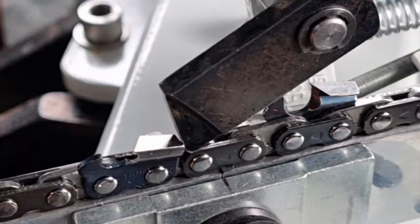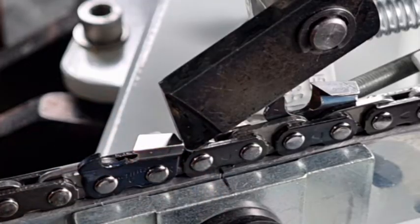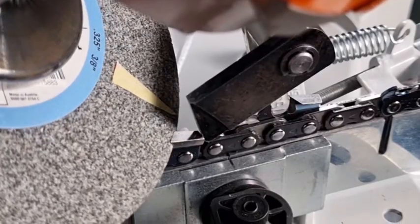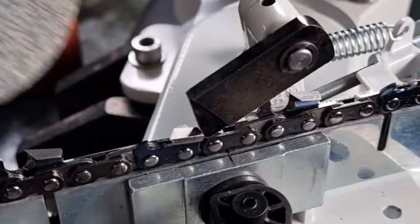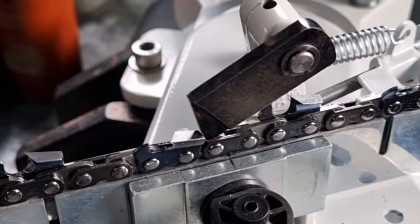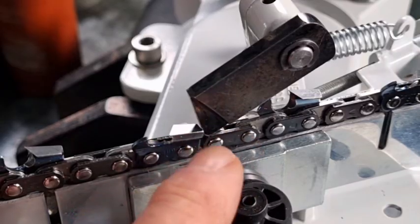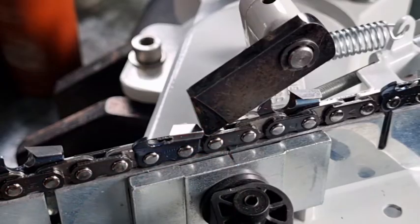When you set it up with the backstop, make sure that when you adjust the knob you bring it up to the face of the grinding wheel so it just touches — that's your starting position where you begin to grind. If you feel it's not taking enough material off, adjust it and give it a little more. If your chain is slightly dull — not damaged, just slightly dull — you should be taking between 0.1 and 0.2 of a millimeter off every time you sharpen it. There's no reason to take half a millimeter off unless it's damaged. A brand new tooth is approximately 10 millimeters from end to end, but because of the end-of-life mark you've only got about 7 millimeters of usable tooth, so only take off the minimal amount of metal required.